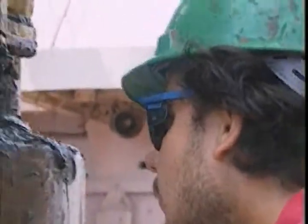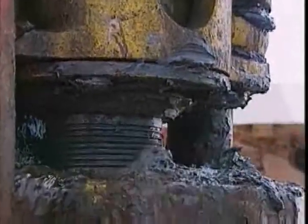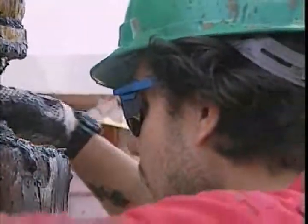The saver sub protects the pin end of the top drive or kelly. If it gets damaged, that damage will be passed on to each box you mate it to — that means every single tool joint box. A piece of equipment that gets that much use is bound to get worn, so you should inspect it regularly.